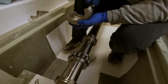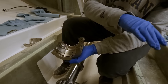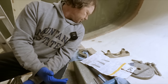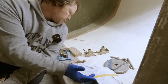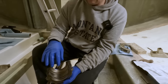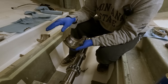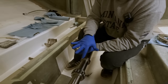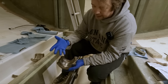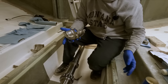Yeah, like you would pack these completely full, and then I guess it also corresponds to how much is actually in this cartridge. So there's different percentages of pack, all the way down to 25%. So for some applications, you would only use like 25%, depending on the speed, RPM, diameter of the shaft, and operating conditions. They recommend 100% pack. And that's just a volume they say on here. It's 5.3 ounces or 150 grams of grease.